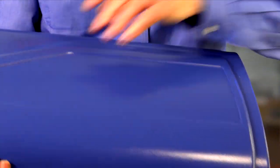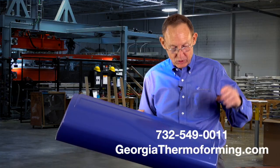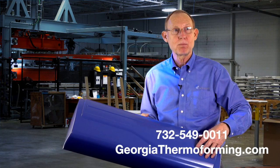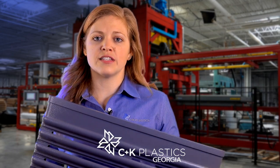Here the customer needed a very tight recess for a label — he wants to be sure that the label fits exactly the same place every time. Pressure forming utilizes female tools and allows us to add texture to our tool. You get more of an injection molding look without the higher cost of an injection mold.